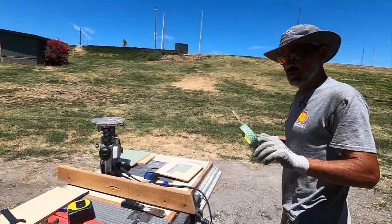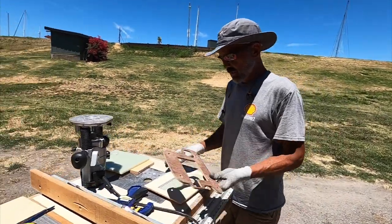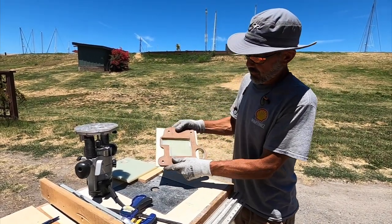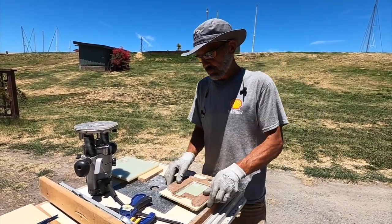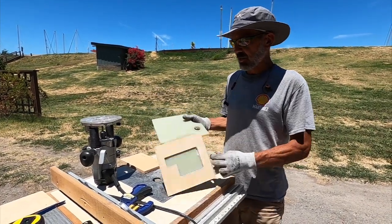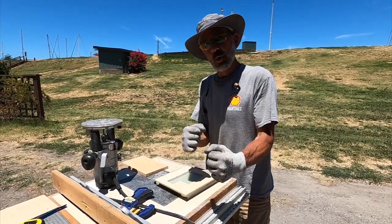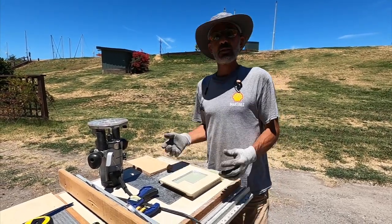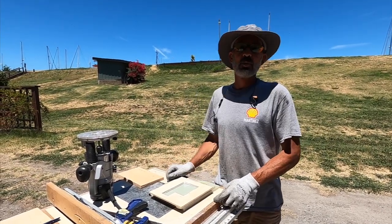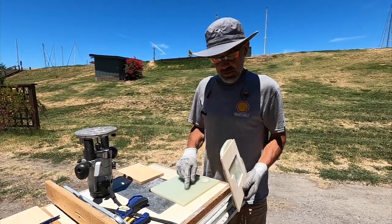For all my pattern making on the boat I use this really thin scotch double-stick tape. Basically I'm creating a hollowed-out section in the G10. Once I get this cut out I'm going to duplicate it in this second set of G10, stick the two pieces together with that tape, and use one as a pattern for the other. Then they get epoxied together after I've hollowed them all out and figured out my cable routing.